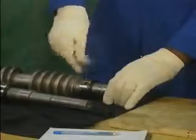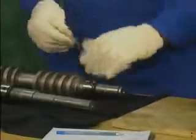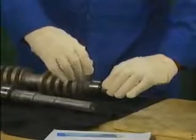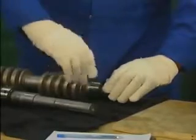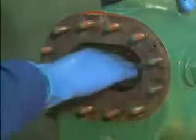After the mechanic puts each mechanical seal in the correct position, he tightens the set screws that hold each seal in place. He is extremely careful to keep dirt, moisture, and skin acids from contacting the sealing surfaces. The rotors are installed next. Before the mechanic inserts the rotors into the casing, he uses a clean, lint-free cloth to apply a coating of clean, light oil to the entire inside surface of the bore.